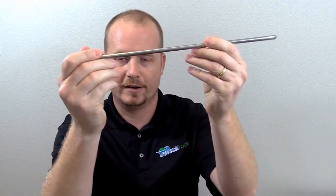The challenge in making these types of readings is that we're tempted to take the reading just at one point — insert it into the duct and take a reading. But velocity varies significantly based on where you take the reading in the duct. If you take it on the sides or in the middle, it's going to significantly change and give you wildly different readings.